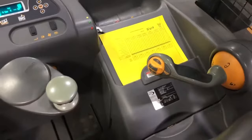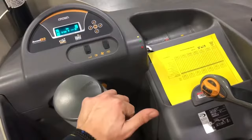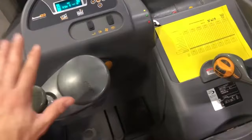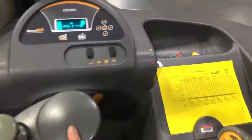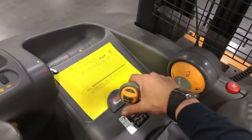I'd like to bring your attention to the two joysticks on this equipment, which are the primary tools for moving your forks and driving forward and backwards. On the left, you have a knob, and this knob is your steering wheel. Unlike other steering wheels on equipment in this facility, this is all inverted. So when it looks like I'm turning right, I'm actually turning the wheels to the left, and vice versa. Reach drivers have to have a huge respect for that — you can't just hop on here and think left is left and right is right. On the right side, you have a joystick that controls the vehicle going forward and backwards. Moving the joystick away from you goes forks forward; moving it towards you moves in the proper direction of travel, which is forward.